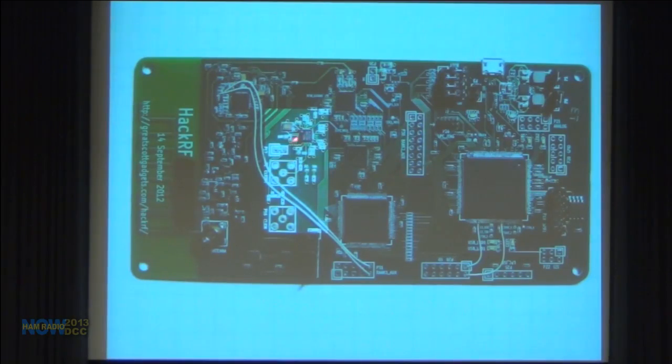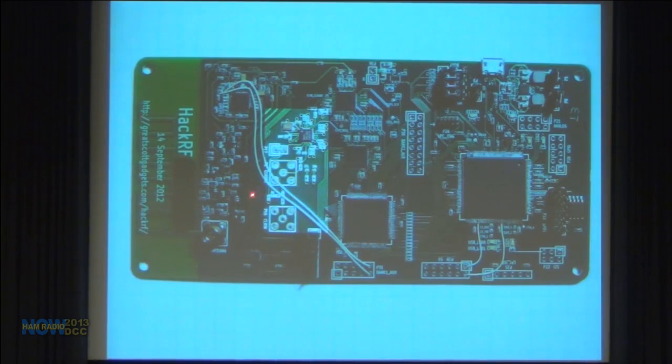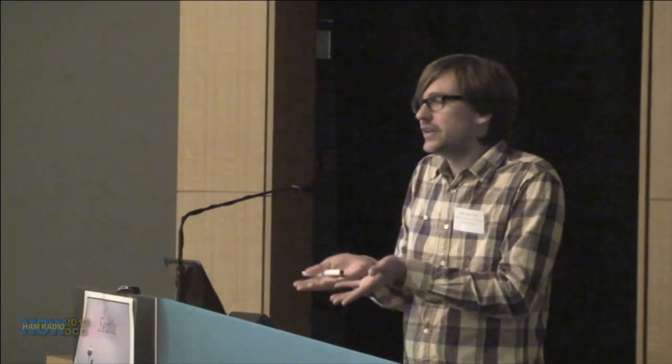The other reason for the high IF is that it lets us reach a very wide range — approximately 6 GHz of operating frequency — with a frequency synthesizer that doesn't need to synthesize frequencies beyond about 3 GHz to cover the whole range, instead of having to synthesize up to 5 or 6 GHz. The clock synthesizer IC is the SI5351C. There are SMA ports for clock input and clock output. I tested clock synchronization about three weeks ago, and thankfully it works — I could connect an SMA cable from one HackRF's clock out into another HackRF's clock in, and they were phase-locked.